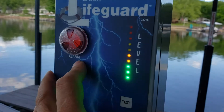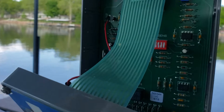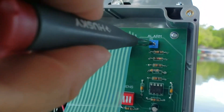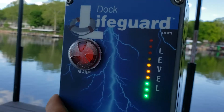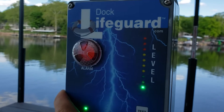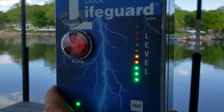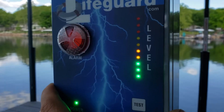The alarm isn't going off yet, so we're going to adjust the alarm trigger point. By turning it clockwise we'll lower it. So now we've set it up with a baseline of 1.25 volts, and we set the alarm to trigger at 1.25 volts over our baseline setting.